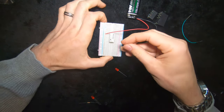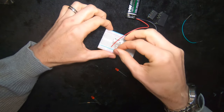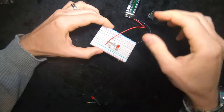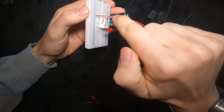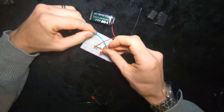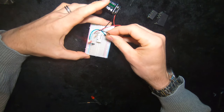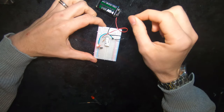Next I want to wire up some sort of circuit. I'm going to take a resistor and plug it into my positive power because I want to run an LED off this, and I'm going to run that into one side of my switch, then take the other side of my switch through an LED to a random space on the breadboard. The positive power comes up here into the relay, through the resistor, through the switch, up the LED — and the power going through my relay is a separate circuit to the LED.